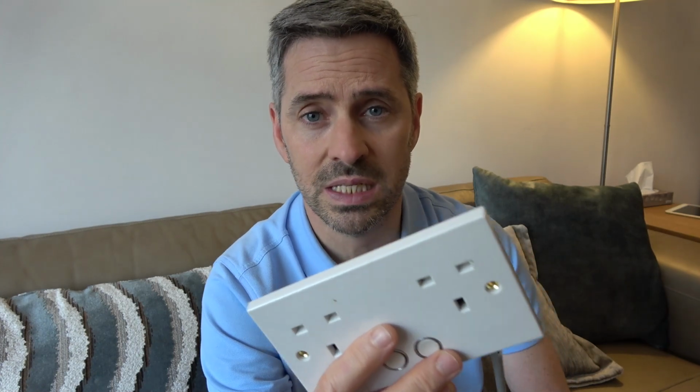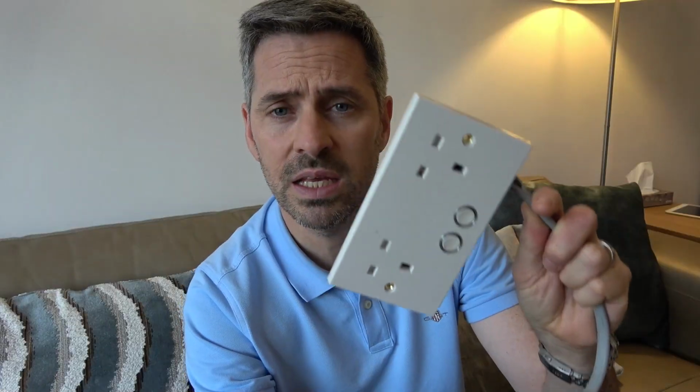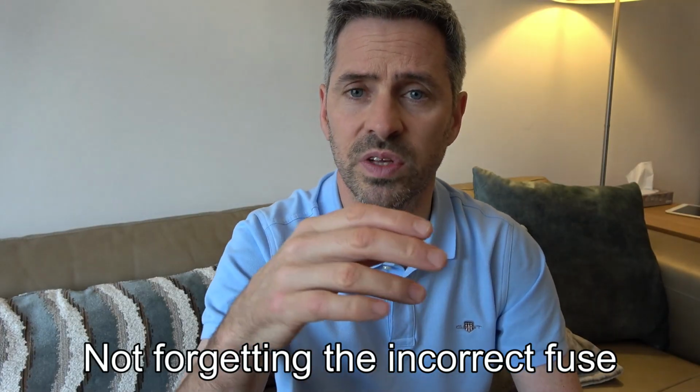And isn't it much more entertaining, in my opinion, to have it working at the end, no matter what it takes, than have it not working? And to prove what the fault was. Personally, I would never use this. It's got a different bridge rectifier in, it's got different transistors and different diodes in as well. Now I'm sure those diodes are just going to be something to do with flyback. You know, when a coil's energized, then when you turn that off, that energy needs to go somewhere, and I think that's what the diode does to stop it damaging other components.